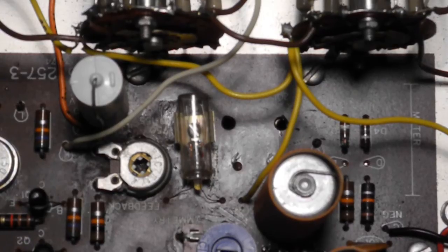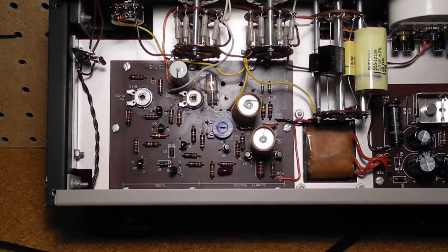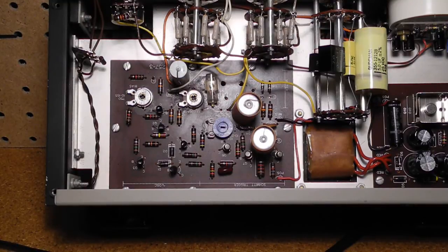The design uses the common trick of using an incandescent lamp to stabilize the output level. It acts as a temperature-dependent resistor in the feedback network. The idea dates back to the late 1930s and was used in Hewlett-Packard's first product, the HP 200A audio signal generator. There are four potentiometers which need to be adjusted during calibration, and the calibration procedure requires an AC voltmeter and optionally an oscilloscope.